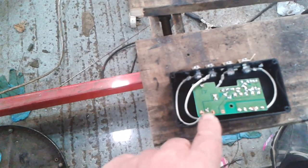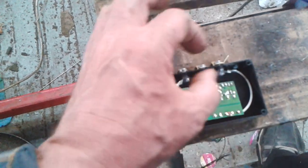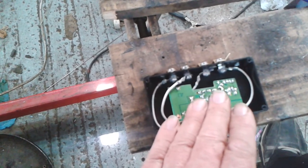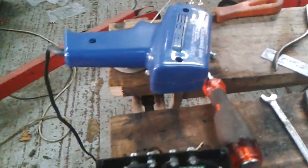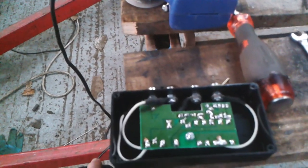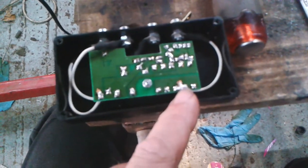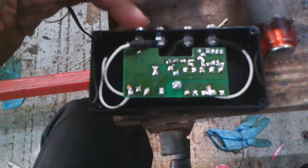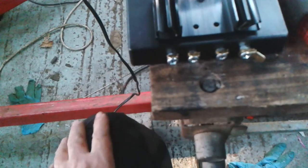I've got to solder those but I can solder them after it's gone back together. Everything's a bit chunky in here — it could have done with everything being a little bit lighter weight. You can just come out with four wires but I wanted to make it a standalone unit. I've just used one of these soldering tools — I had to borrow it because I couldn't find my soldering iron. There's the finished item. That's a solder of the four wires, and these are in the position lined up with the four holes. I can look on the wiring diagram and know which wires have to go on these four connectors.